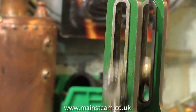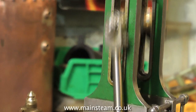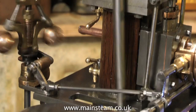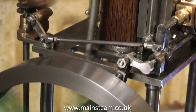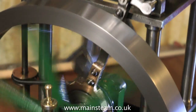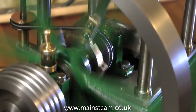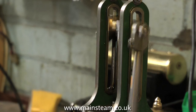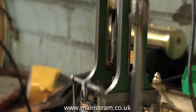This is a Stuart Turner James Coombs engine — it's a very unusual engine with the crosshead above the cylinder and a very complicated linkage from the eccentric to the valve chest. One problem I've had with this engine is that the eccentric is still a little tight, causing the valve links to kick slightly and make a slight noise, but after a while this will disappear.